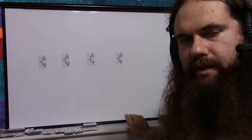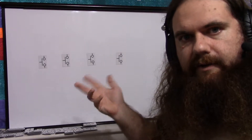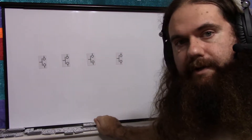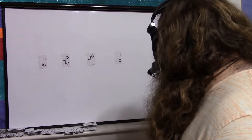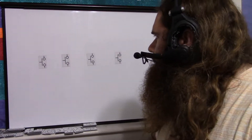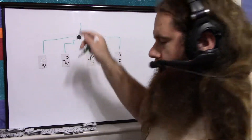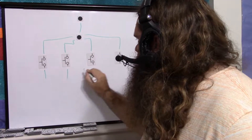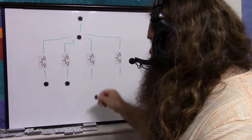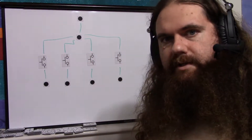Let's look at a quick circuit diagram. I have four switches — momentary switches, also known as buttons. The wiring is quite simple: all four on one end go into a junction, and that is a pin on the board. The four on the other end are also pins on the board. Which way the signal goes through the switches is up to you.